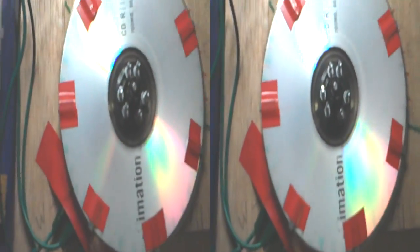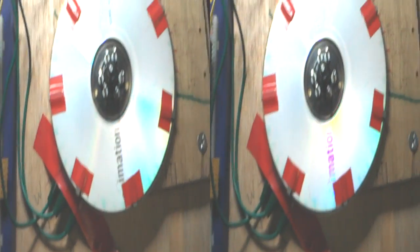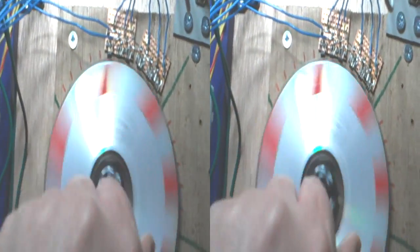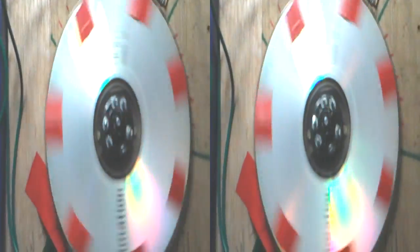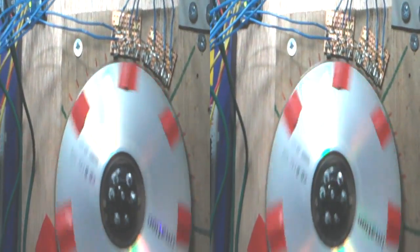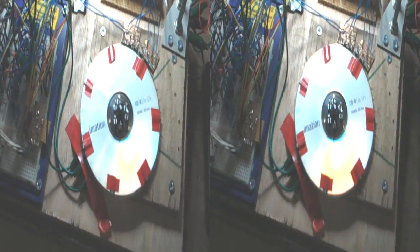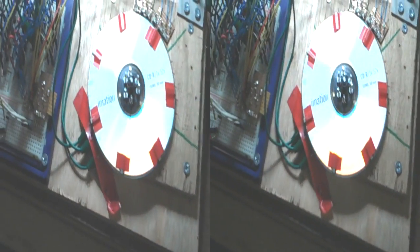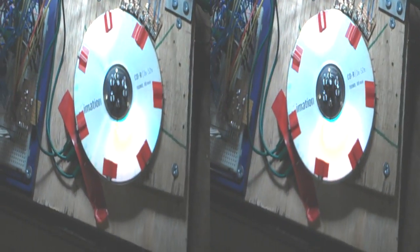So that's 300, and if it was a six-step sequence, that would be driving at 120 plus miles an hour if the motor was powerful enough to do it. Our motor isn't, it's a 30 kilowatt. And another thing it isn't doing is, when I'm spinning it, I'm making interrupts happen from the sensors. Which is a fair point. And for very small marks and very small spaces, what I could do instead is simply put a for loop in there if it's below 10% or something. Okay, so we're just testing the top end of the capabilities of the controller, basically. It seems okay.